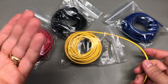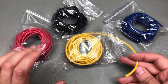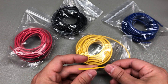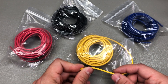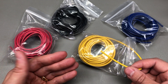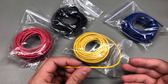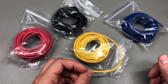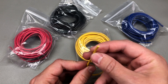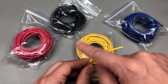Also in the cabling department, I needed some thicker 18 AWG UL1015 wire for various wiring jobs on prototypes at my electronics workbench. For 20 AWG or 22 AWG I typically recycle wire from old ATX power supply wiring, which also helps keep them out of landfills. But 18 AWG is typically not present in ATX power supplies, so I ordered a lot of these — 5 meters per color, which should last me a while.